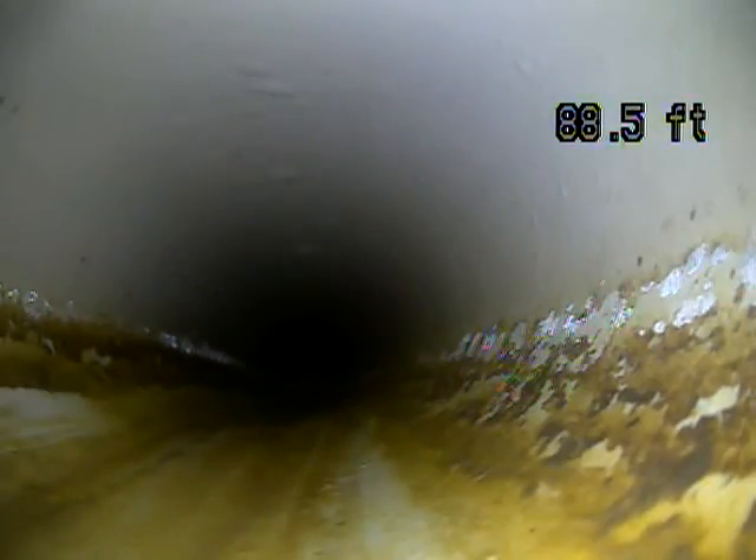Once you go through a couple of tight turns, sometimes you can't get it all the way out to the city line, especially if you're going from inside the house through a couple more tight turns. We'll look at this part here, and then I'll go outside and see if I can access the other part of the line. So we're about 93 to 95 feet out from the clean out in the basement. The average line is about 100 feet, so I'd imagine we're pretty close to the end in either case.